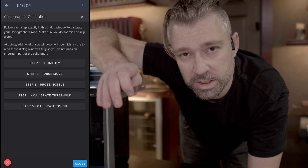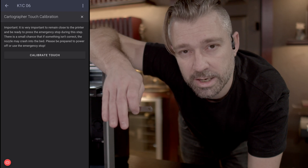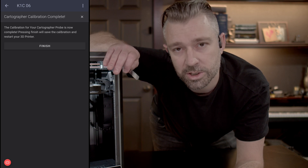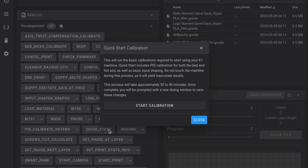Once the printer restarts, open the calibration macro again and complete the last step. Step five is the last step - go ahead and hit that and just follow the dialog windows as they come up. Once we press finish we're completely done calibrating the Cartographer 3D - this will save and restart the machine. Before you start printing, go down to the macro section and run another macro I've created called quick start. This will go through all the basic calibrations you need - PID for both your nozzle and bed, as well as input shaping - before you can begin printing. These calibrations aren't set by default, so it is very important that you run quick start before you attempt your first print.